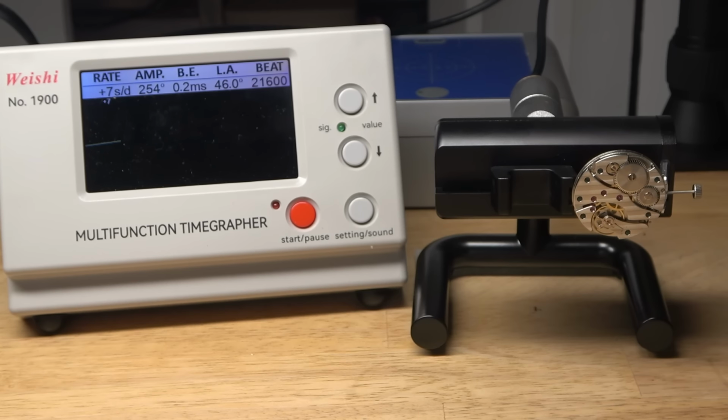Crown left was at 16 before. So it looks like this improvement is good. I mean, if we settle in at 6 or 7, I would be more than happy, because if that's the case, then our delta has been greatly improved. Remember, when we took our initial reading, before we took the movement apart, it was 15, our delta rate. All right, so that's 5. Take it.